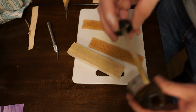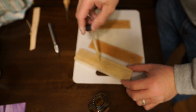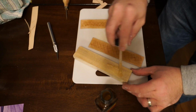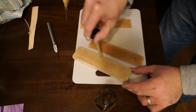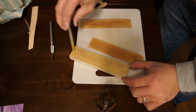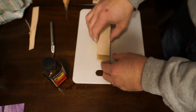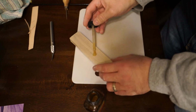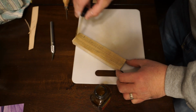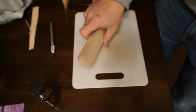So once I stick it down, I smooth it out with my hands, apply pressure. You can use something hard, like the side of a mug to press it down, or like a glass. If you have a heavy glass, you can take the bottom of the glass and rub it on the leather, and that'll push it down. You want something that's really smooth, so you wouldn't want to use the bottom of a mug that has the ring on the bottom. That would mess the leather up. Or you can clamp it to your countertop or something. You don't really need much pressure, but if you wanted a really flat surface, you could do any of those things. For this purpose, I didn't do that.